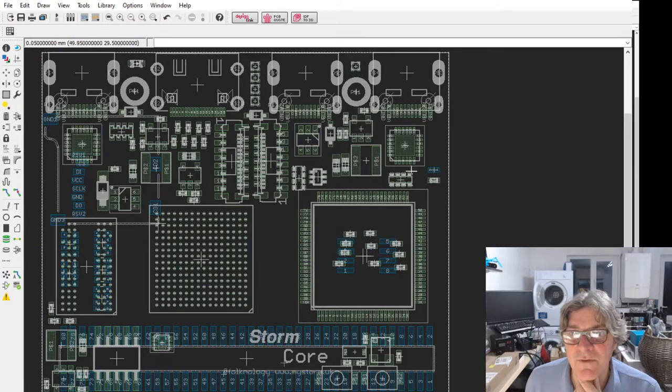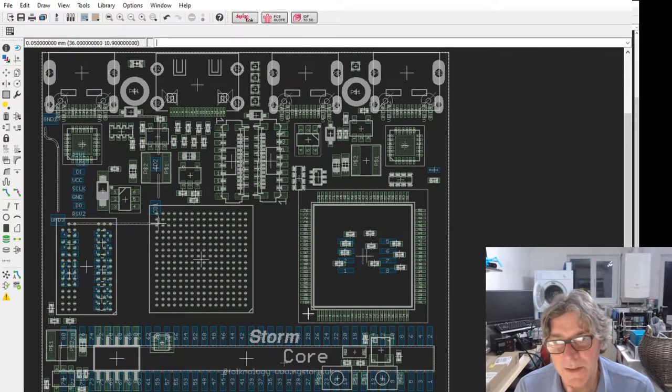So that is really it. But in terms of what comes out on the IOs below, to interface with the board below, we've got 64 digital signals from the ECP5, or it can be 32 differentials, if you like. They can all be differential. So we've got a really good selection of those. There's a relatively short path between the ECP5 and the connector as well.